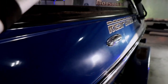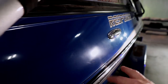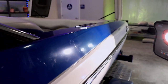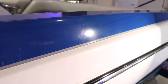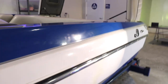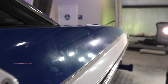It's not crazy oxidized but it does have some medium oxidation. The really crazy part is all of these deep holograms and scratches — you can see them swirling around. These scratches come from improper buffing from whoever detailed it last, or just from using the boat. Swirls are the ones that swirl around the light — they come from your boat cover, improper washing, anything abrasive. The holograms are actually from the buffer — whoever detailed this boat last left them from their buffing machines.